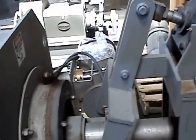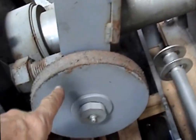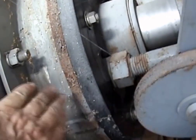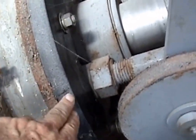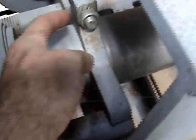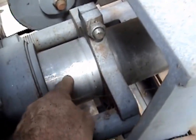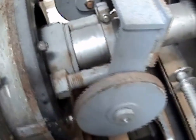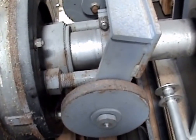Okay, we were right there. And right here, I got one with a rotating cone feature. Notice this one is pushed in with the wheels. They press against this plate. So that's my cone right there. It happens to be shut all the way. Notice I got this big pin screwed into the cone, and it is latched onto this collar right here, and this collar is clamped onto the shaft of the screw. So as the screw shaft turns, this collar turns, this pin turns, and the cone rotates. That's the feature I think we should use on the beeswax.